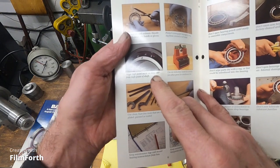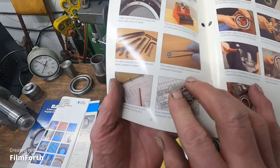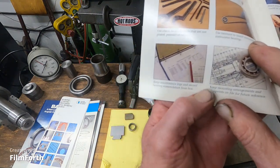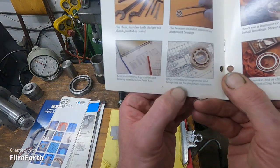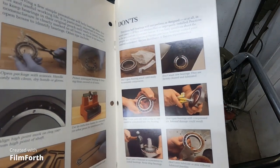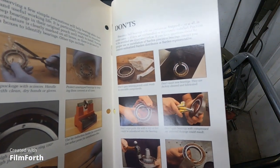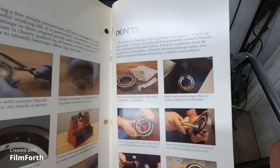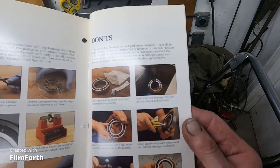Align high points 180 degrees from the high point on the shaft. Use an induction heater and the right tools — including tweezers for miniature bearings. Keep maintenance logs, keep your blueprint. Write down your reassembly procedure and the order things go in. You don't want to install a bearing only to remove it because you forgot a spacer — that will damage the bearing.